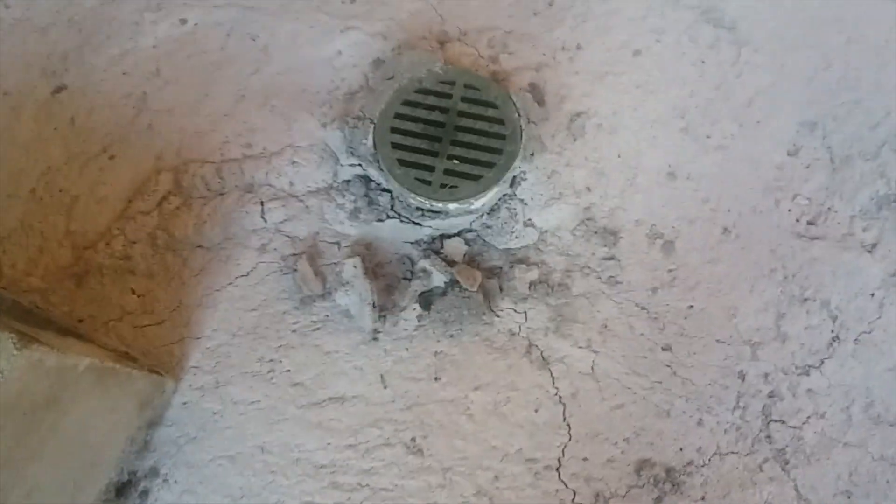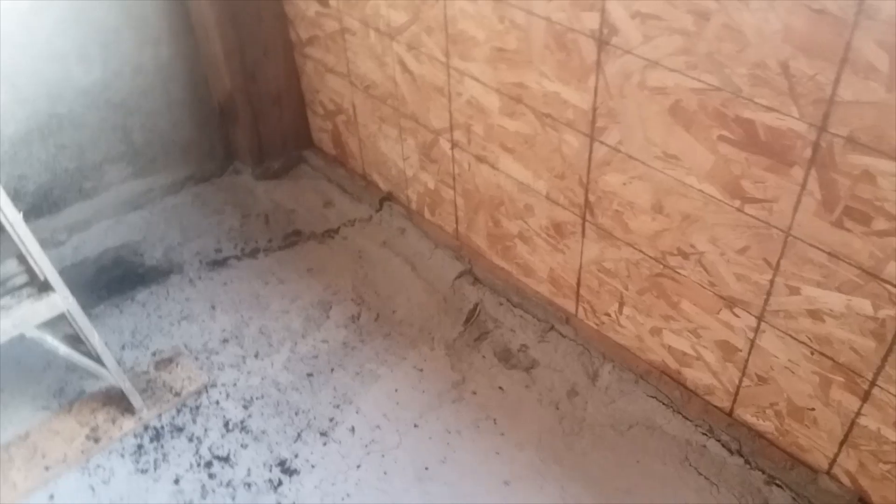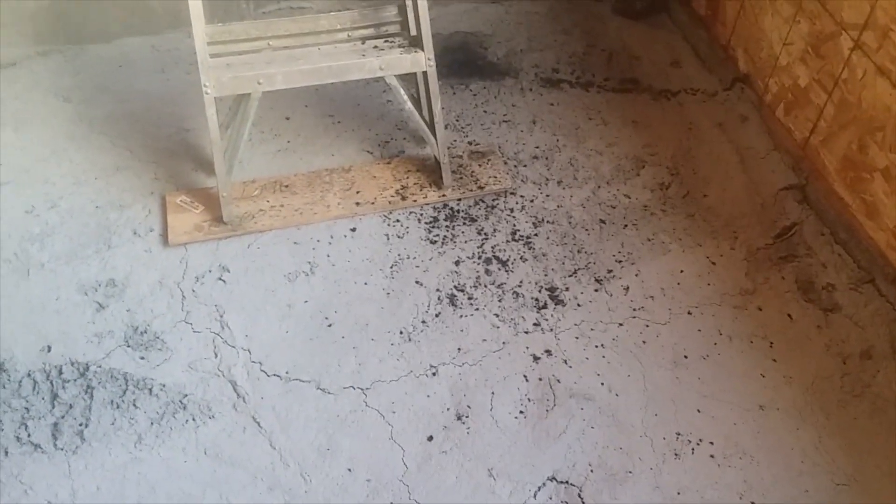I'm not knocking it — I think it's a great thing if you can get it to work. That concrete block there is where I put my drain in. I had it perfectly level and so far it's still level. I'll probably cut that back a little bit. I'm going to make some sawdust concrete because that'll give good insulation. All I want is this floor to be insulated so when the sun shines in it will absorb the heat in winter — I'm going to have an overhang so it won't shine in here in summer, keeping it cool.